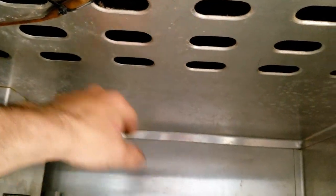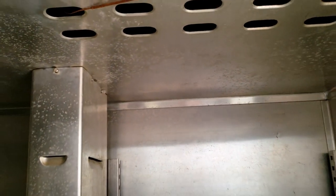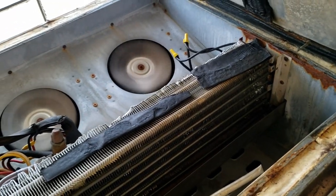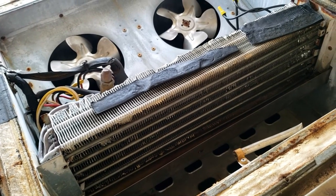I don't smell anything — oh, I think I might have found our problem. I think we might have lost our fan. They said it got hot smelling — well, I would too. And that's also what would make the superheat really low: no fan. Let's open the top and see. The fans are not running — no fans are running at all.